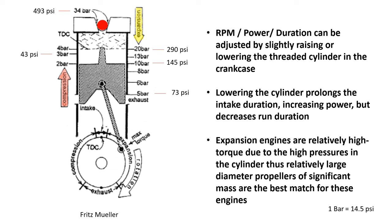Looking at the left side of the pressure diagram with the red arrow, as the piston rises, there is an inescapable compression cycle where a pressure of 2 to 3 bar is reached before the piston pin starts to open the ball, which is otherwise held tightly against the seat by the supply gas pressure. There is a short period where the gas supply is entering the cylinder while the piston is still rising, and it is this part of the cycle which requires sufficient component momentum to push the piston up and over top dead center instead of backwards.